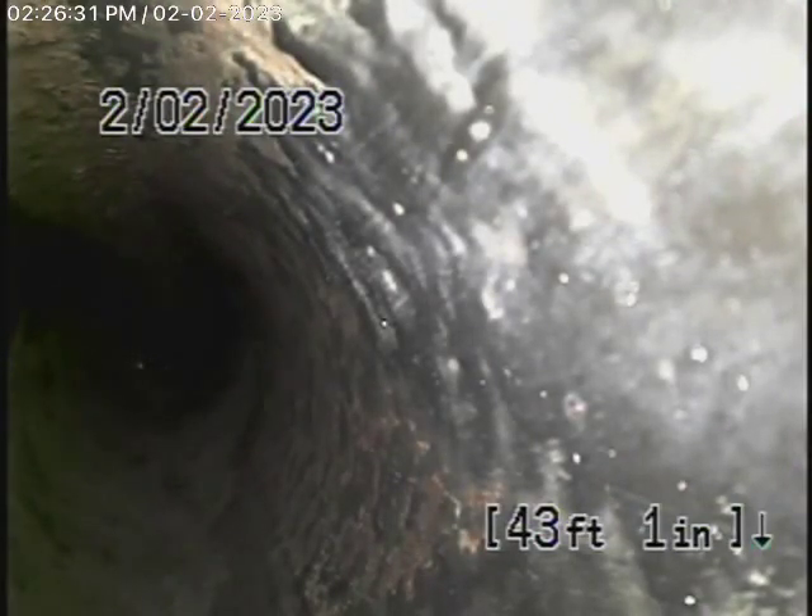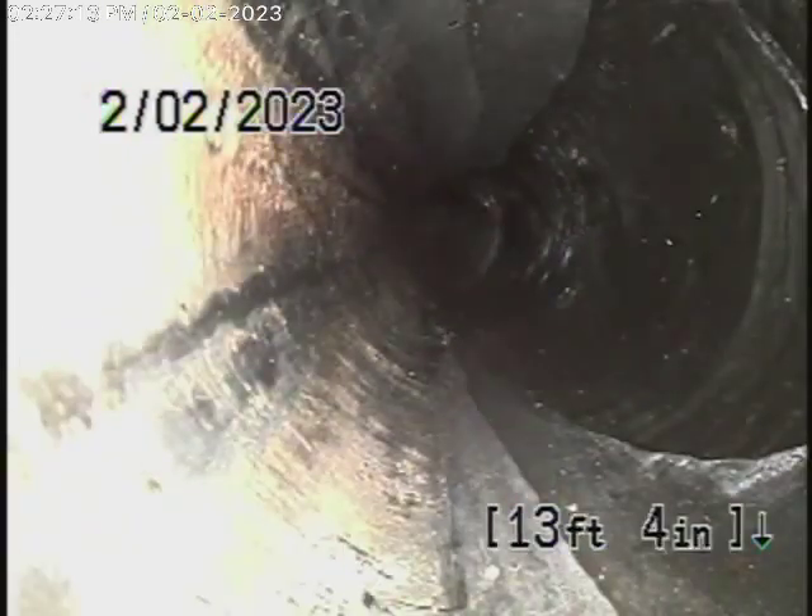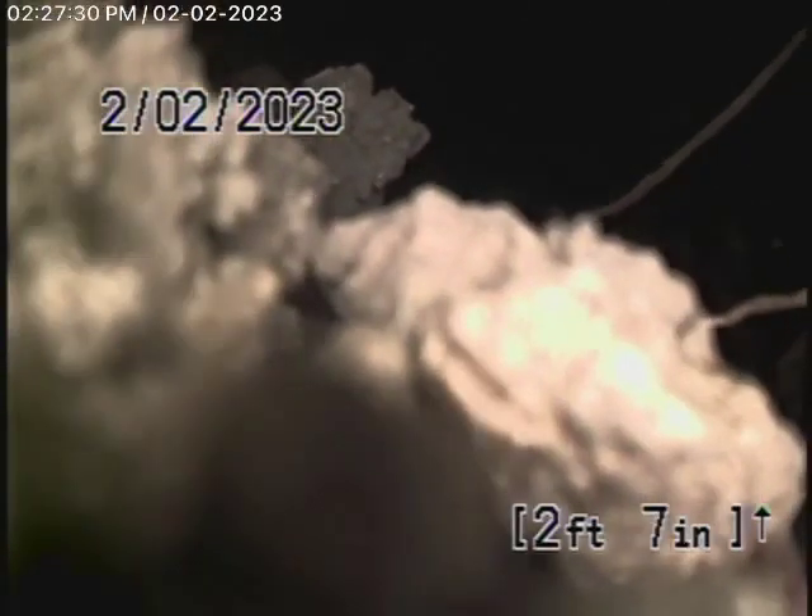We're running the camera from a clean-out located underneath the main house, just to confirm that everything is ABS plastic. It's all ABS plastic on the main house, going into the main line all the way down the driveway — all in excellent condition. The lateral going into the street is in very good condition. The cast-iron pipe coming from the guest house as well as the pool house is obviously getting a little old, but still appears to be in fair condition. Those two suspected areas where it might be cracked — it's very difficult to say, especially in a cast-iron pipe. It may not be cracked; it could just be the discoloration of the rust, because there are no roots getting into it. We will give you an approximate estimate for repairing those two spots if necessary, although I think it's probably going to be pretty good.